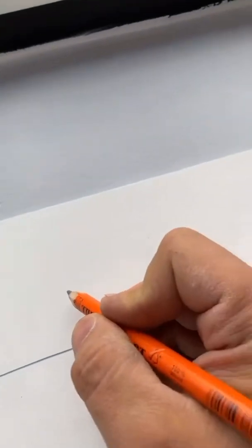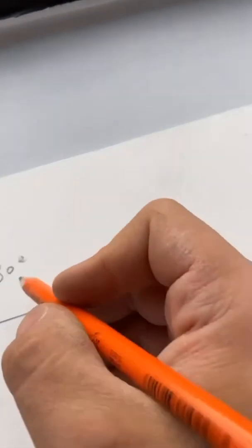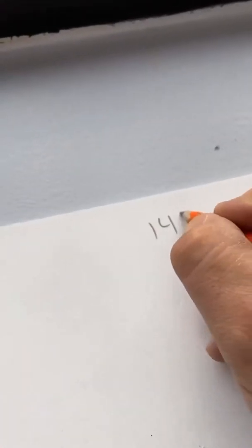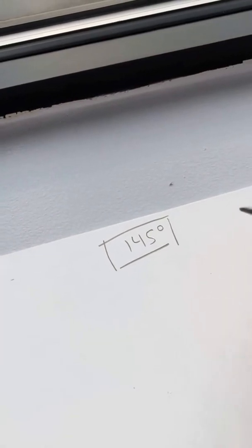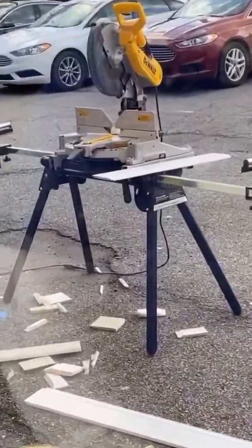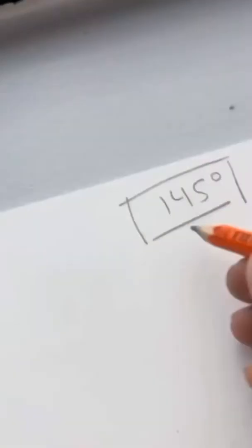The math for a straight line is always 180 degrees. So if you measured your corner and it gives you 145 degrees, you can't cut that directly on the miter saw — because half of 145 is 72.5 degrees, and the most you can get out of a miter saw is a 45-degree cut, some have 50, but either way that's still not enough.